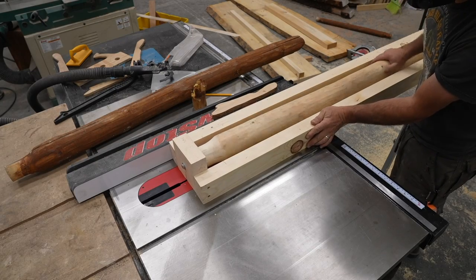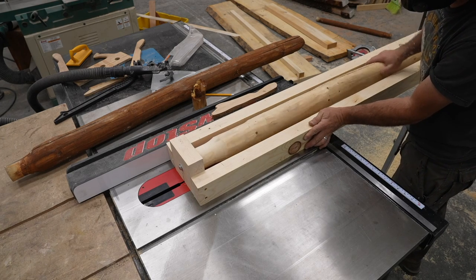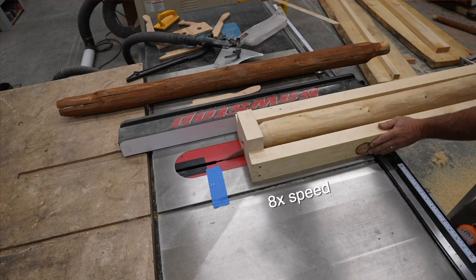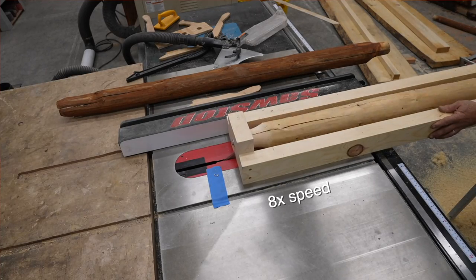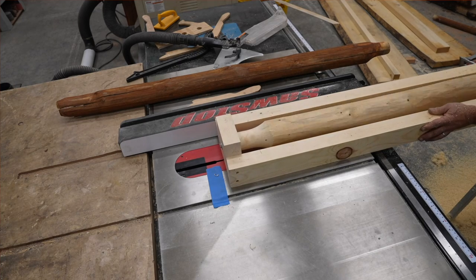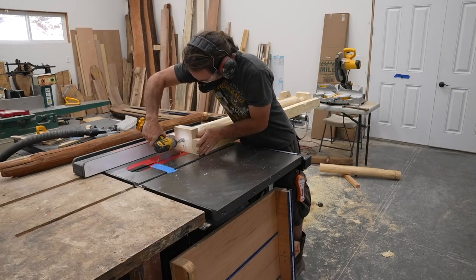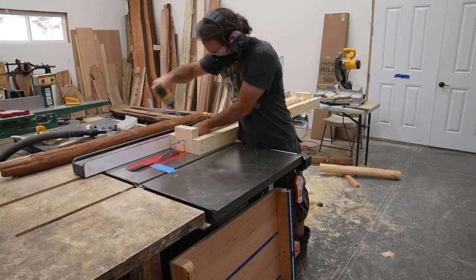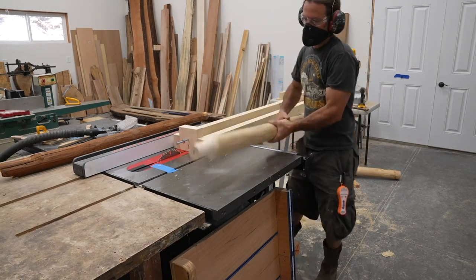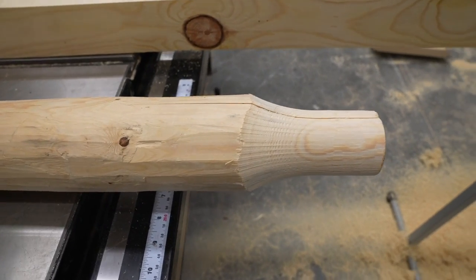To use the jig, I slowly move the entire jig along the fence on the table saw while rotating the log by hand as I move it forward to perform the cut. If the tenon is a little too big to fit into the mortise hole, I just raise the table saw blade a little and cut it again until it fits. I cut the mortises with a Forstner bit. I can get the same length tenon on each log by marking the end location of the jig on the table saw with some blue tape. The result: perfectly clean-cut tenons with a nice pleasing curve.